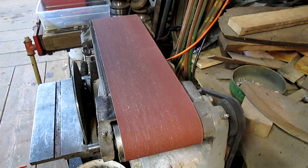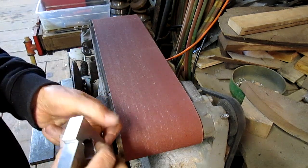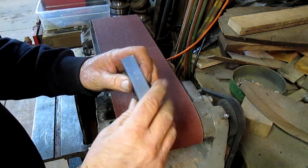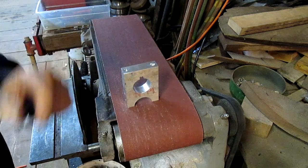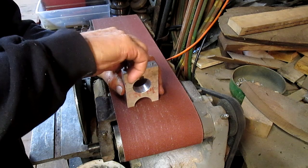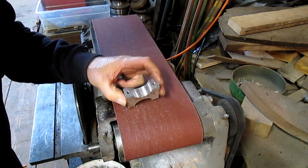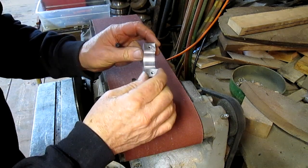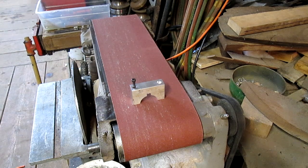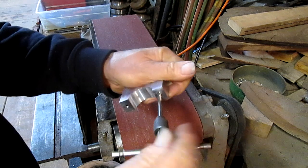So we want to do it all at one time, don't we? So I put little index numbers on here so I could have everything pretty right. Let's get a couple of bolts. And does it not want to go in or what? Well, when I countersunk the holes, it kind of put a little burr on the inside there.